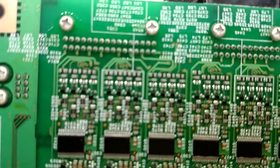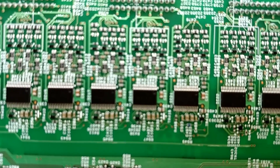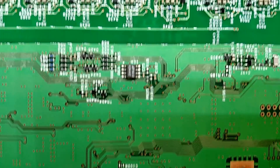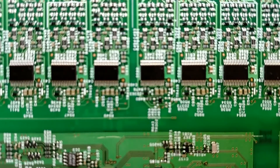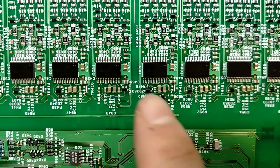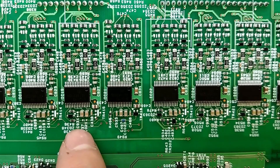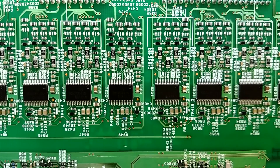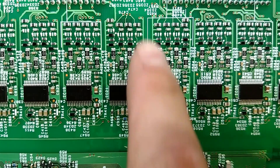Here's the other side — it's very similar. This is the other half of the balancers. You can see right here they're all in little isolated groups, but there is a trace that comes from over here, crosses to the next group via a resistor, and then another resistor crosses to the next group, and so on. That's how they're doing the communications between the different sections. This line right here is where the optical isolator on the other side breaks the middle of the pack.